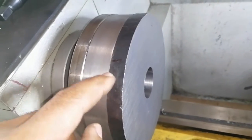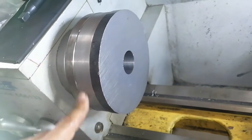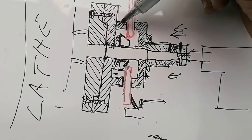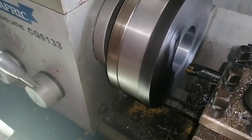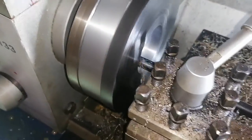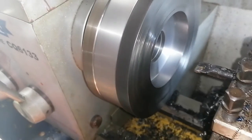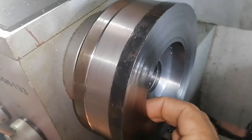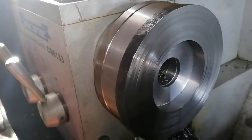This isn't exactly as tight as I would like — there was a little bit of play — but we should get away with it. Let's see what happens. I'm at the stage now where I must machine that disc down to sit on the brake disc. Okay, the inner part is done now, didn't come out too bad. Let's just check the size.